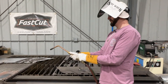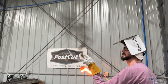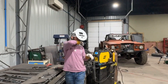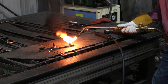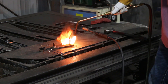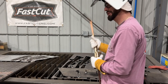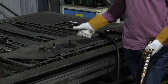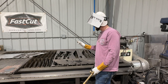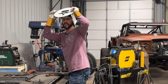Another solid tip is going to be sooting up a bolt. You get all this stuff that comes out of acetylene — you won't see this on propylene or propane. All this black soot, I like to call them parachuters, or as Beau likes to call them, sky snacks. We're going to use these little sky snacks and just brush the bolt. We've already welded one bolt. You could just soak it all in there, and this is like a poor man's anti-spatter. We ran out of our can, but we do have a handy torch around. Now that this soot is all on this bolt, none of those BBs are going to be able to stick to it.